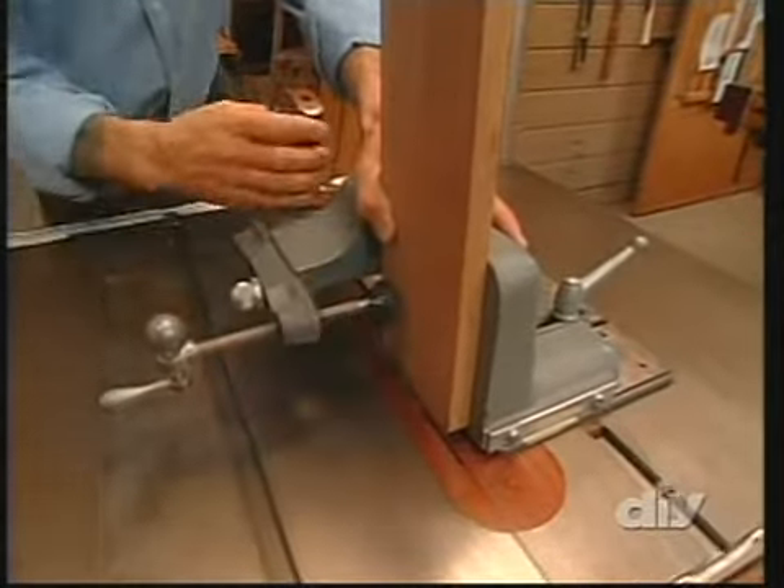After cutting our cheeks, we change the setup on the table saw to cut our shoulders all the way around the tenon — raising the saw blade until it meets the side of the tenon. For the rails, we butt it up against the stop block and rotate it to make all the shoulder cuts. On the aprons, we want a deeper shoulder to add strength, so we raise the blade and cut a notch in the side of the stock. Then on the bandsaw, we cut out the notch, giving us a deeper shoulder along the side of the tenon.